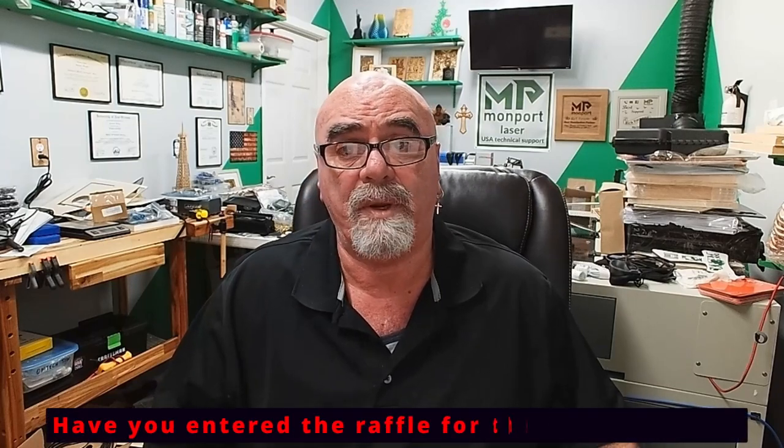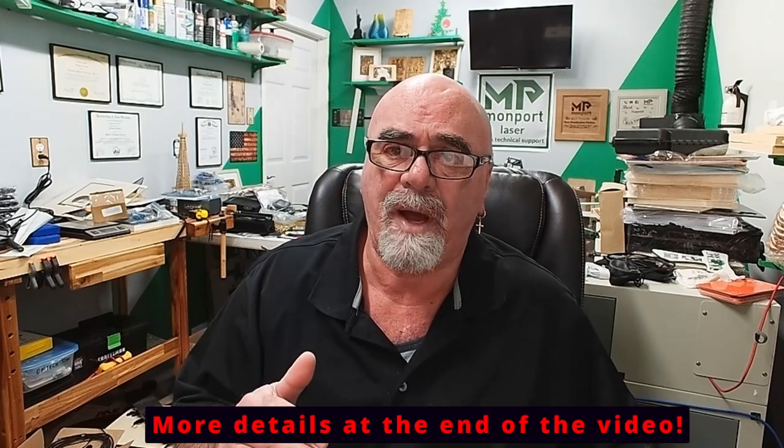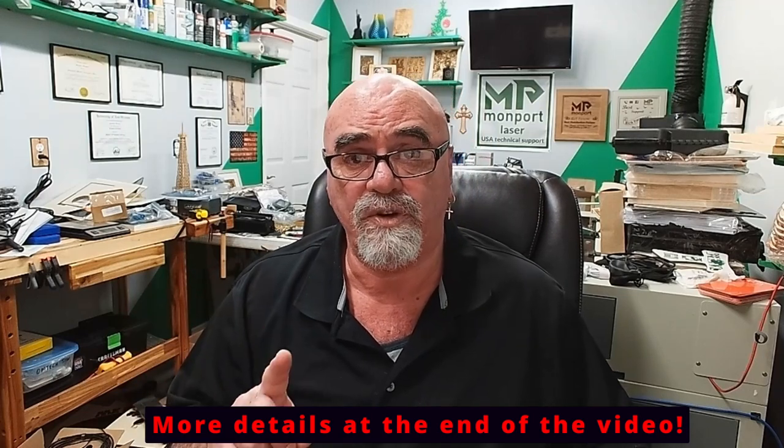Hey, it's Rich, the Louisiana Hobby Guide. Today we're going to be talking about setting up LightBurn for your CO2 laser over Ethernet. A lot of problems people are having with their engravings and jobs not running properly is because they're using the USB connection. You can use USB, but Ethernet is the most stable way to connect — you won't drop packets, you won't ruin any jobs. Today's video is all about how to set up LightBurn for the first time with the CO2 laser as well as setting up your RUIDA controller.